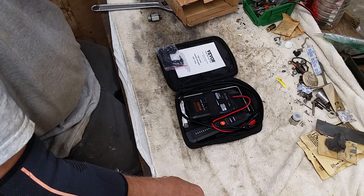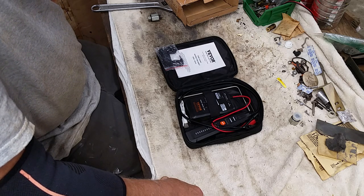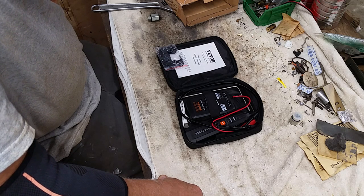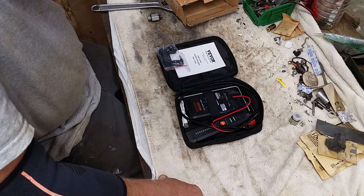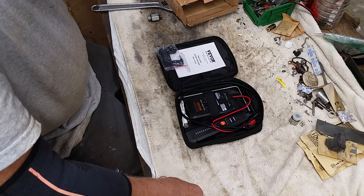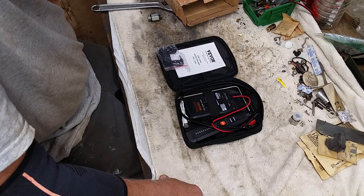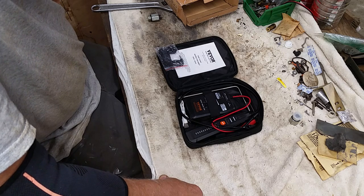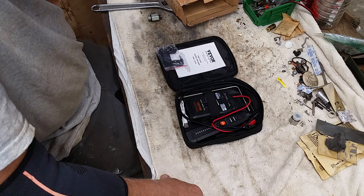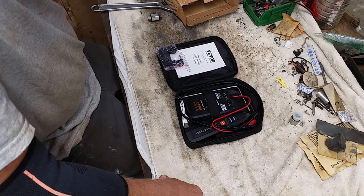And that has to do with how well the radio waves travel underground as opposed to above ground. So the scenario, if you saw outside, was that I was going from inside my garage where there was 18 inches of underground Romex UF in a piece of pipe that was not grounded. Went underground about 70 feet, then came above ground through a piece of conduit, which I guess you'd say is fairly well grounded. It was buried in the dirt. But then I had 80 feet of UF sitting on top of the ledge, which put it up in the air, above ground, of course, which makes it a much better antenna than the stuff underground.